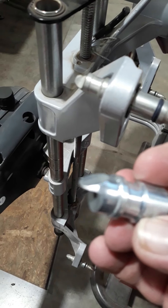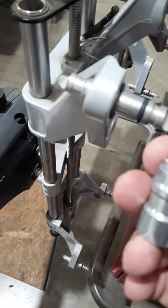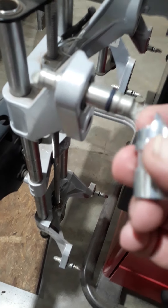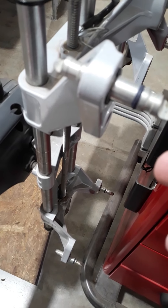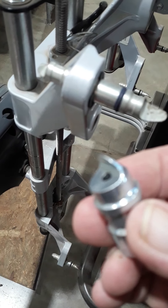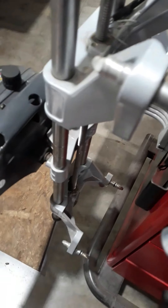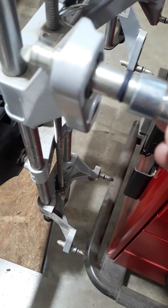You've got to make sure these sensors don't come off, because if they hit the ground it will knock them out of calibration. It'll cost you six to eight hundred dollars to have the company come out and recalibrate the sensors. You have to make sure you install them with the right adapter and properly. With aluminum wheels you can't grab the inside — the Alcoa adapters are made to go around the outside of the aluminum wheel. There's a little O-ring on the adapter that lets it snap into place.